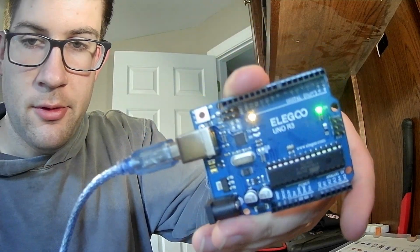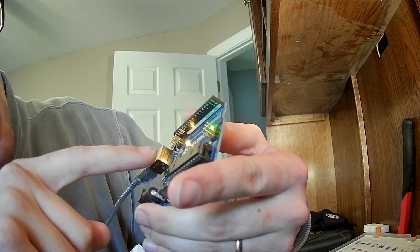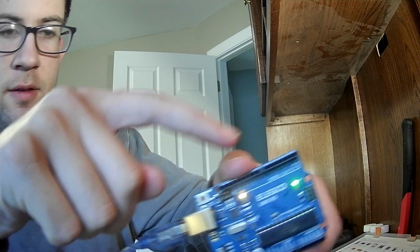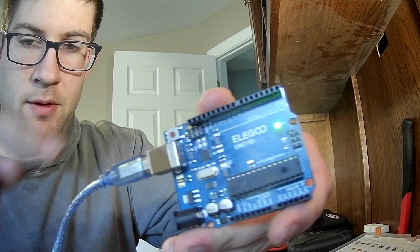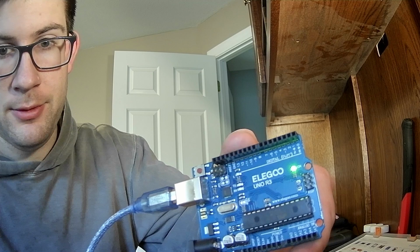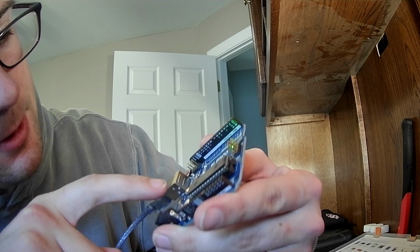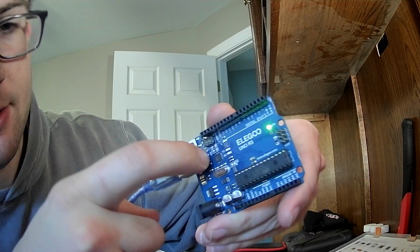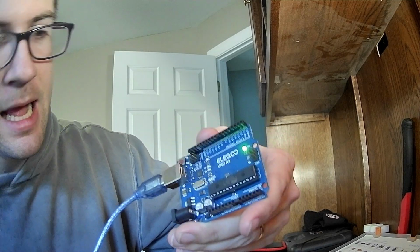is that you're looking at this board and you're like, okay, which pin is pin 13? Is it one of these pins that I can actually plug into? No. What you've got to remember is that this whole thing is actually just a package that helps you talk to the actual device, the actual microcontroller. The actual microcontroller is that little guy right there. It's doing all the thinking, all the brains. Everything else is just attachments to other stuff,